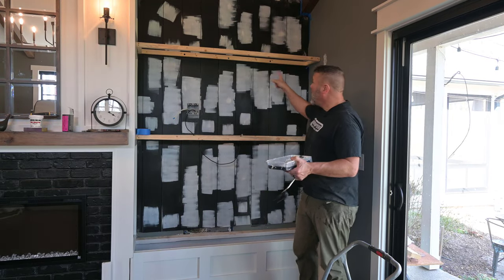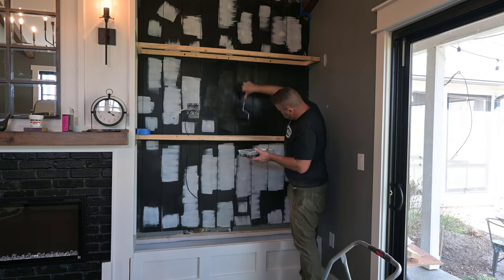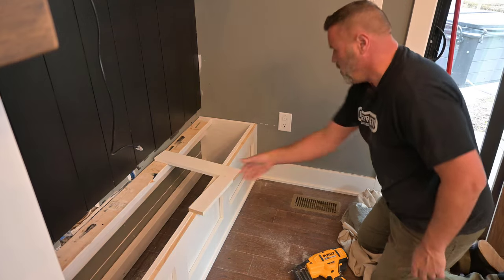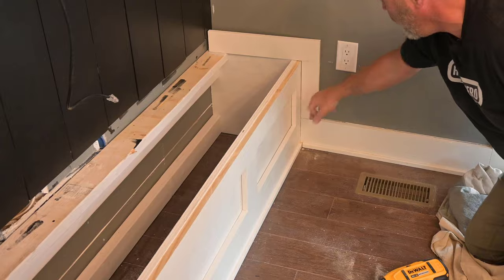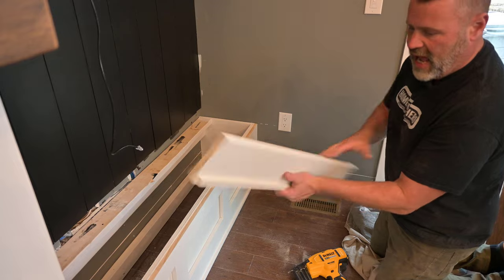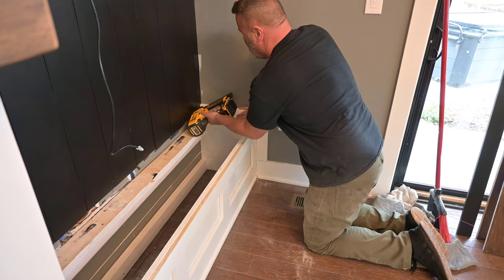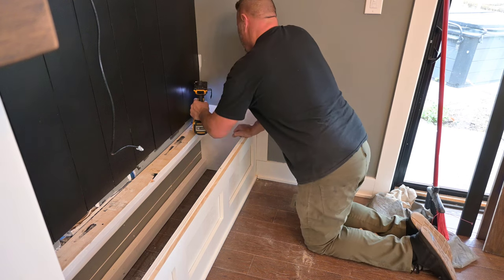I'm going to move inside and knock out the black paint. Got everything primed up, got everything filled — may have to put two coats on just to make it look good. I'll do some pocket holes right there to kind of dress it out. I kind of like wood on wood — it's equal amount here to here, I like the balance. This is ready to go on too. I just cut it down, took the nails off the back. We're going to liquid nail all this stuff and install with 18-gauge two-inch nails.